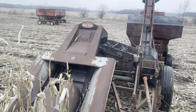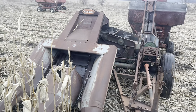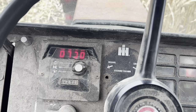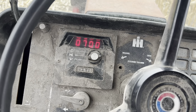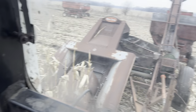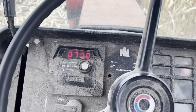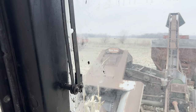I'm just gonna let it sit here and run for a few seconds. I don't hear any weird noises coming out of it, everything appears to be spinning, no hammer clutches hammering. That knocked it down 30 RPMs. I'm not gonna go all the way up to the full thousand that it should be running at - this is based on the 1000 shaft, but this is 540, so when you're running the 1000 shaft to 1000 RPMs the 540 is running at 540. We're probably just gonna go to 700. Everything seems happy at that - actually that's 790. There's just a missing number in there. Okay, 800 sounds good. Just kind of run the old equipment at whatever it sounds good at.